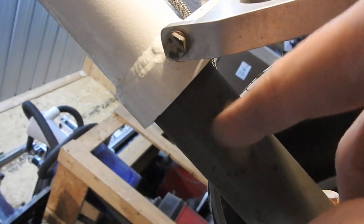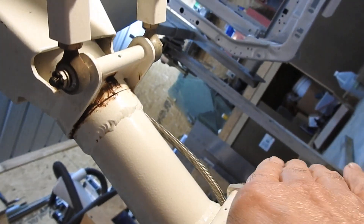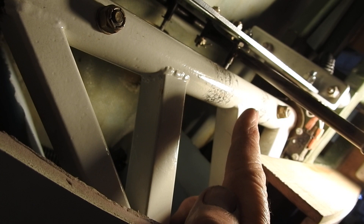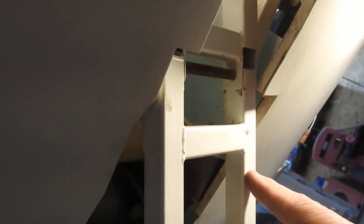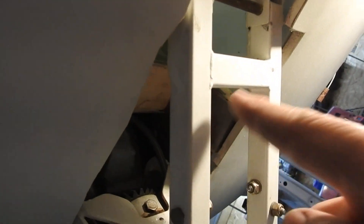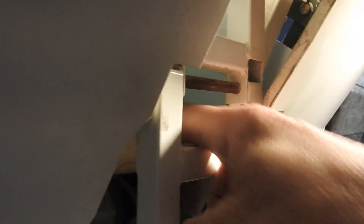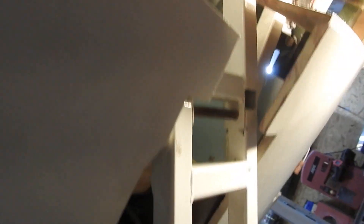What happens is when this gear goes up, this area right here on this side — because this gear, the tire swings around this way and lays flat — that spot will literally come up and just about touch this, and that gear mechanism is going to hang down about that far. These are the toggle links and this is the torque tube, and this is a scissor joint. So when this tube rotates, it rotates up that way. This joint right here goes straight up, so this thing folds like that — pulls the gear right up in tight.